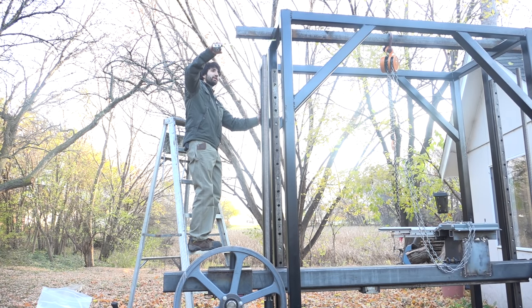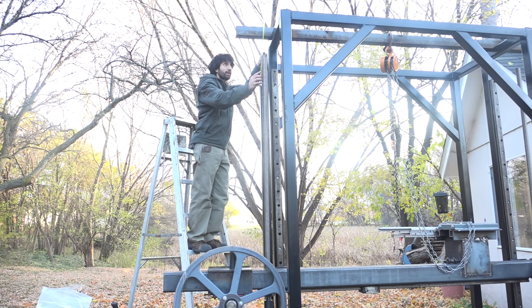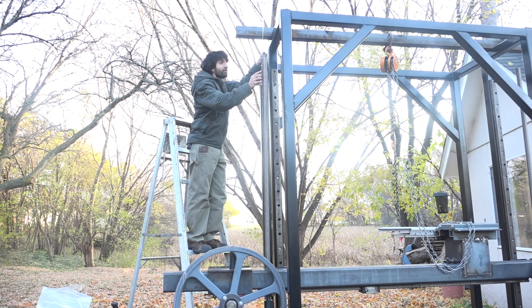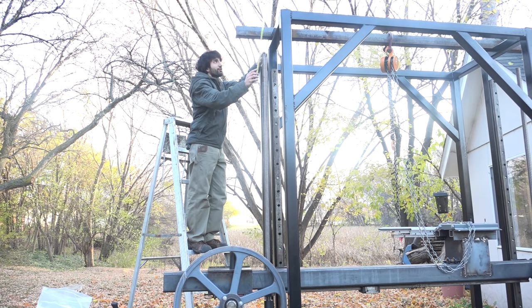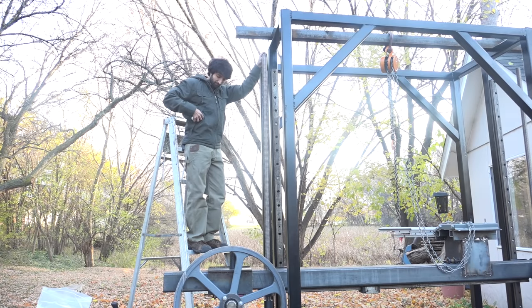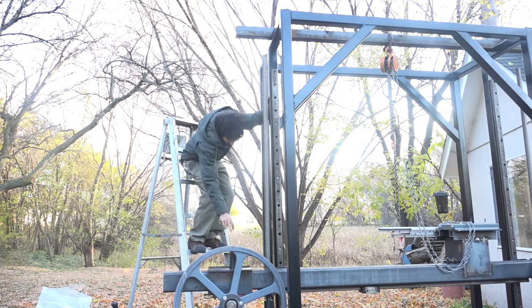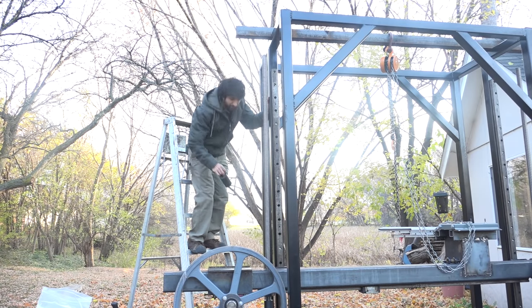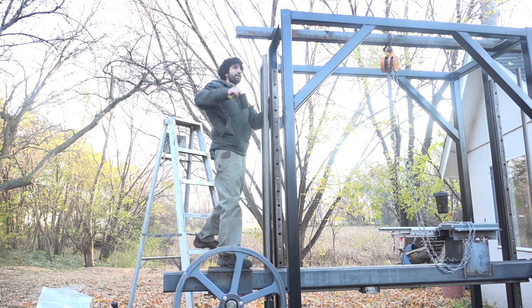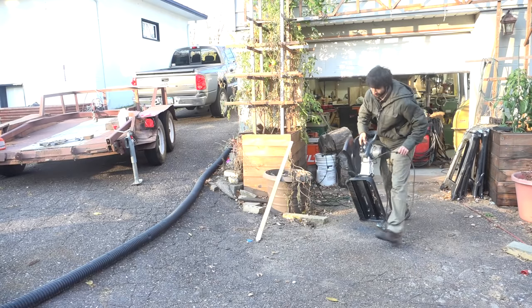I think I should have plenty of room to make everything work. If I cut maybe a 12-inch section, that'll put me about four inches above the top of the carriage, and I can always trim that back later. While I'm up here I might as well install this coupler. I'm not cutting a keyway into these Acme rods just yet — the coupler seems to be grabbing it just fine, so I don't know if I'm even going to cut one. Let's go cut some shaft.